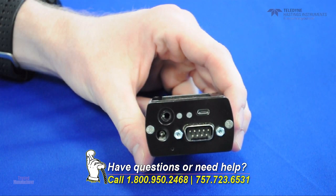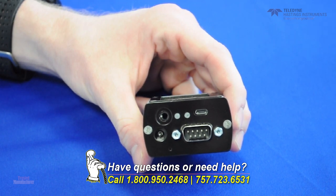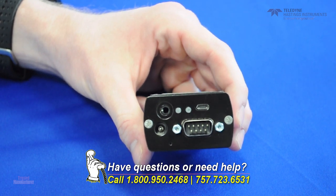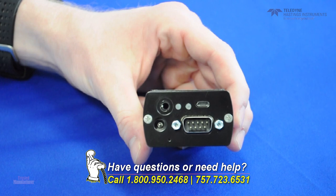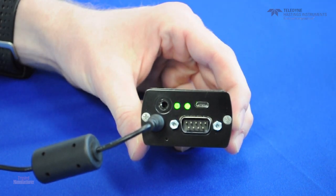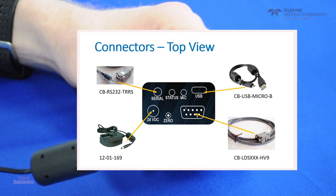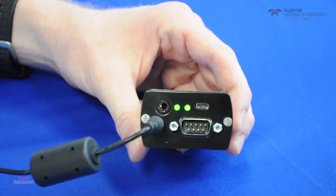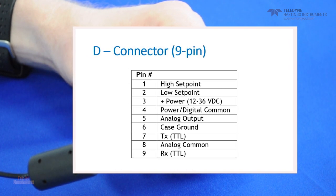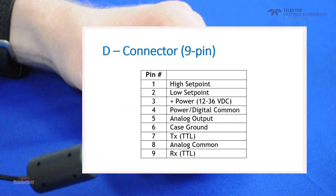And speaking of connections, let's take a look at those now. The HVG 2020A is very flexible in that sense. Should the user opt for a non-display version, they will have access to the analog linear signals as well as easy-to-use digital communication. Let's start in the lower left-hand corner. The HVG is easy to power up. You can plug in a 24VDC supply via the bayonet jack and you are up and running — fast, easy. You can source the power supply through us, or you can use your own. If we need to wire up the linear output signals, we can do that by using a 9-pin D-connector. The wiring for the D-connector is straightforward. If you don't use the 24VDC bayonet jack, you can power the unit on pins 3 and 4 and get the analog output on pins 5 and 8.